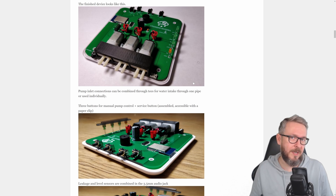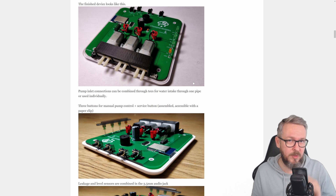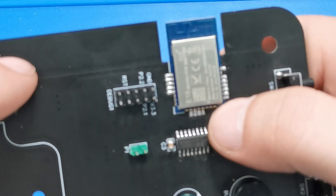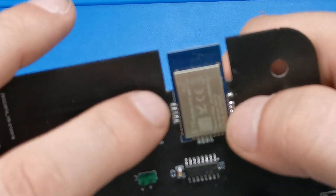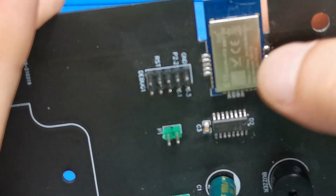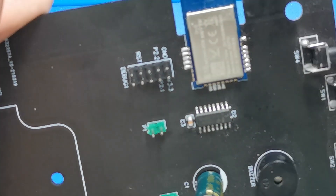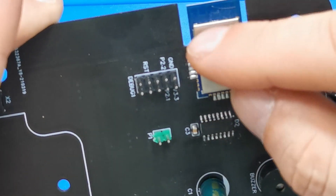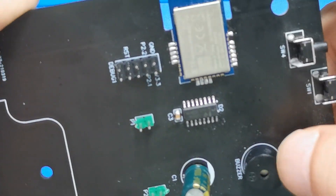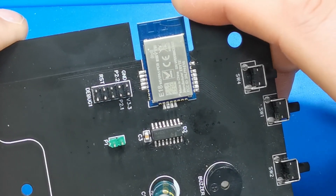And this is it. I did have a lot of issues with the board — let me show you what was my biggest issue. The biggest issue was once again the Zigbee module. You have to orient and position it so that all the pins on the left side and the bottom align with the white line, so that only the necessary pins are soldered. The problem is that solder went under the board and caused a short — all the pins on one side were shorted. That's the biggest issue for me when soldering with the hot air gun.